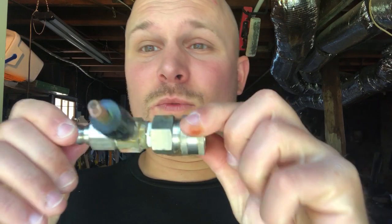These are pretty unique in that they spray a ratio that's pretty good for cleaning vinyl houses, hardy plank — stuff that doesn't really require a lot of hot mixes like a soft wash unit where you want to blend sodium hypochlorite and water at really high ratios. This won't do that. This is for everyday vinyl houses, or if you want to pre-treat a concrete driveway at a low ratio. This will give you roughly 20:1 to 10:1 depending on your water flow and your gallons per minute.